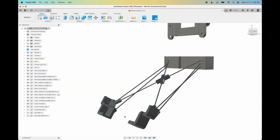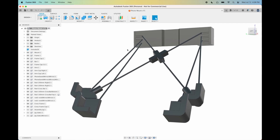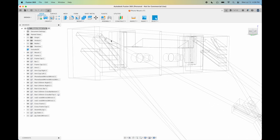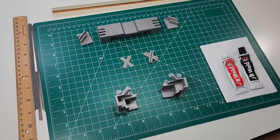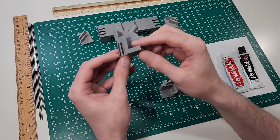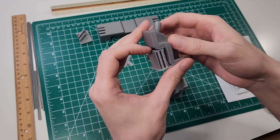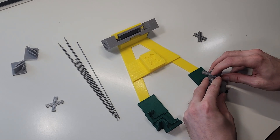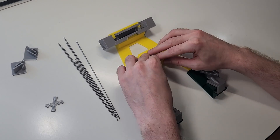At this point, I was ready to design the holder for the phone. I wanted it to be as low profile as possible, so I split the phone holder into two halves and connected it by a series of two millimeter metal rods. I used silver PLA to complement the metal rods, and support material was unavoidable but pretty minimal, and it was pretty satisfying to remove. After popping it off, I was ready to begin assembly. I printed a jig to hold the 3D printed parts in their exact position relative to each other during the assembly and glue curing process.